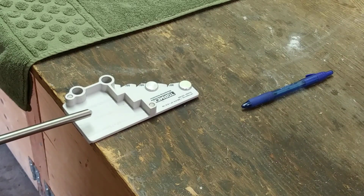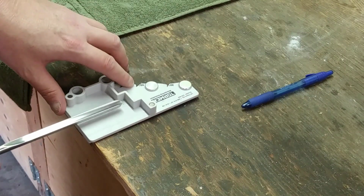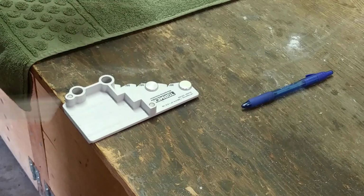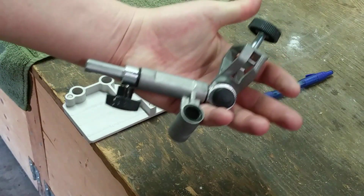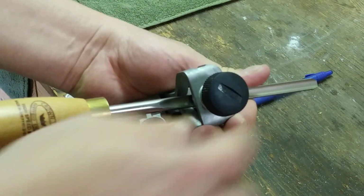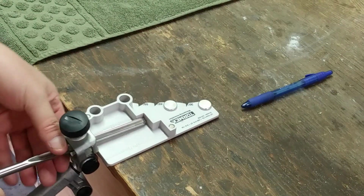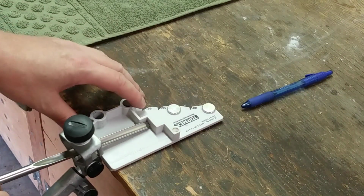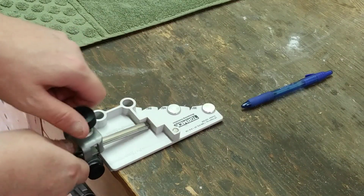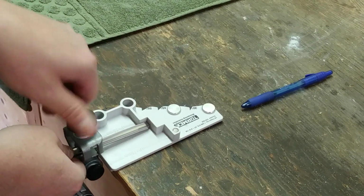So in this case, I'm starting with my spindle gouge. On the back side of the TTS 100, I'm using slot number 2, which is 65 millimeters. The jig I'm using is the SVD 186, I think, and it's another Tormek jig. The elbow for the SVD 186 is set to slot number 2. And as I get close to having it tied down, having it in place, I then put my gouge into the second slot for 65 millimeters, and I press the SVD 186 up against that spot, and I secure it.